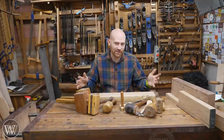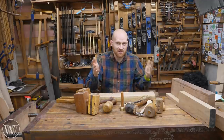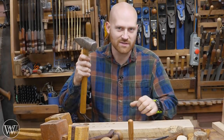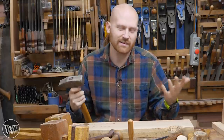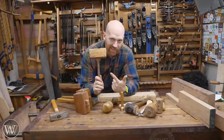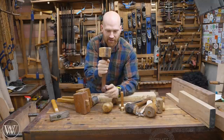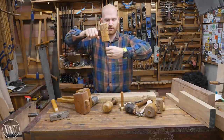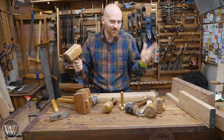These are just the mallets I use on a regular basis — different people are going to want other mallets, and there are hundreds of other designs out there. If you ever watched the English Woodworker, he uses a little three-pound sledge to do his mortising work. I find that to be a lot of work on the hand, not to mention a metal face on the wood chisel. But a lot of people like that. I also have this mallet that was made for me by one of the viewers. Most of the time the handle is shaped so your hand is in line with the head, but this one is shaped for your hand to be out of line with the head. Every now and then you need to do chisel work up where your arms are, and it's very nice to grab it and tap that way rather than trying to work in an awkward position.